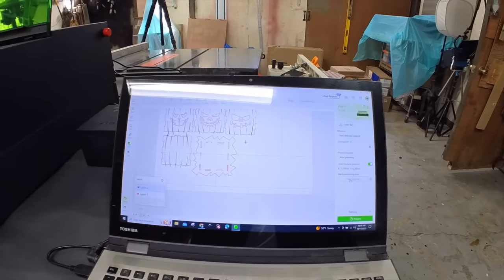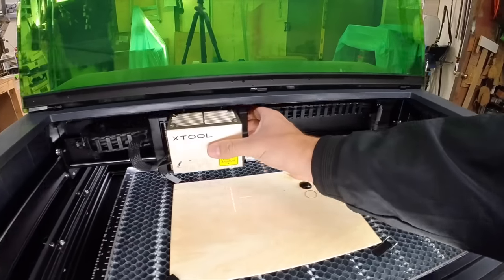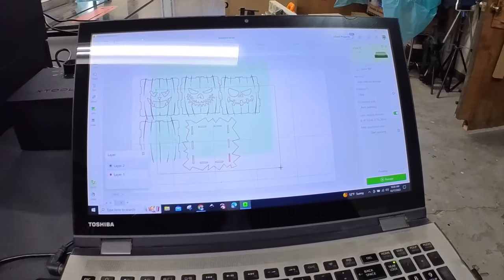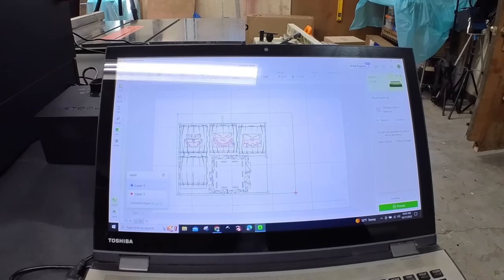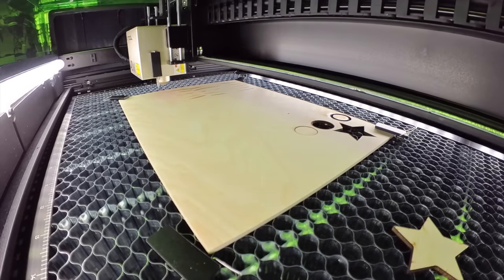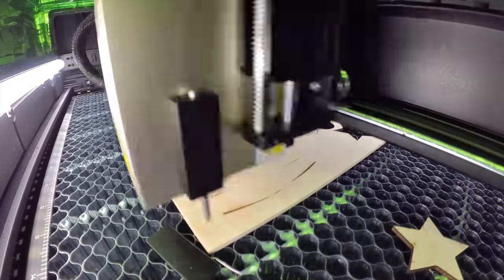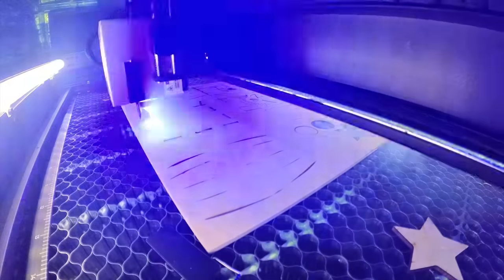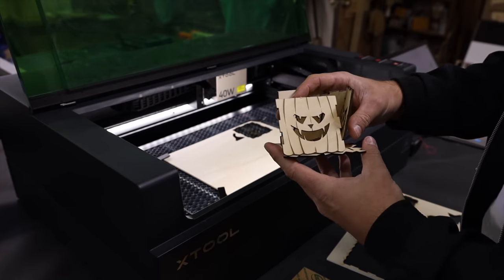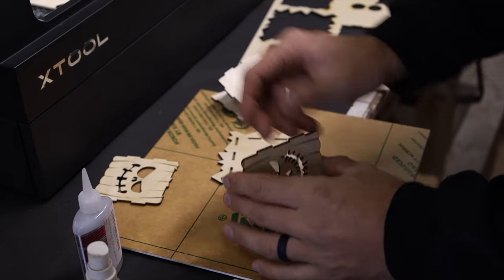Now I'm going to use the two-point marking to see if I can fit the design on the material, manually bringing it up and over into position. It looks like I just need to grab everything and shrink it down until it fits onto the piece of wood. The engraving and cutting for this project took about 44 minutes. I believe if I had rotated the images 90 degrees so the design was horizontal with the way the laser head moves, it would have greatly sped everything up. A little super glue is my friend right now, and now we're just going to make him into a lantern.